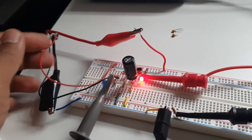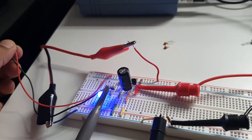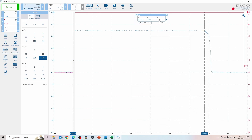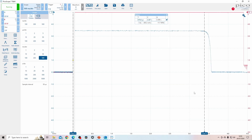I've powered it on and I'm going to press the button - you can see a really long pulse now that you can actually see. The pulse duration is 3.3 seconds. Putting that into the calculator with 470 microfarads and 10 kilohms gives me 3.5 seconds approximately. So the measured pulse is 3.38 seconds - very close to what I was expecting. The pulse width formula is 0.76 times R times C.